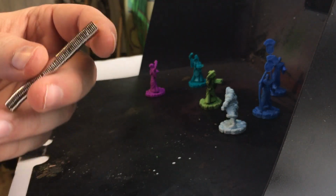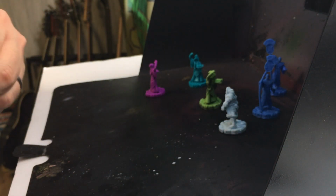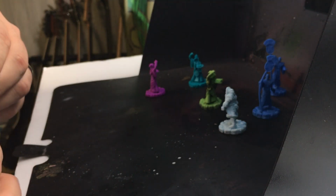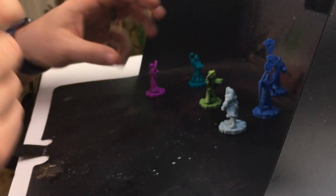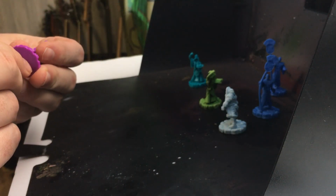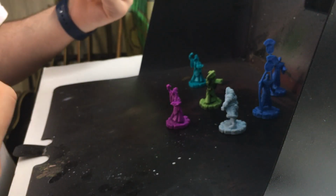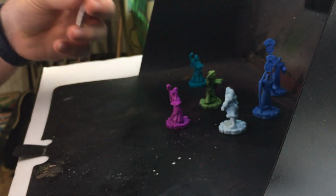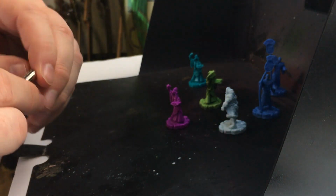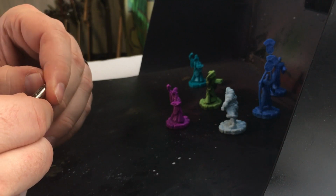There we go. So I wanted to start off small, and I ordered a small amount because I thought maybe I might need 1.5 or 2s. But I thought if I got 1s, I could double them up if I needed to. And after putting the 1s on, flipping my metal tray, they all fell off. So 6x1 neodymium magnets are not strong enough. So I went ahead and ordered 2s, and I'm drilling at 2mm depth on our jig.